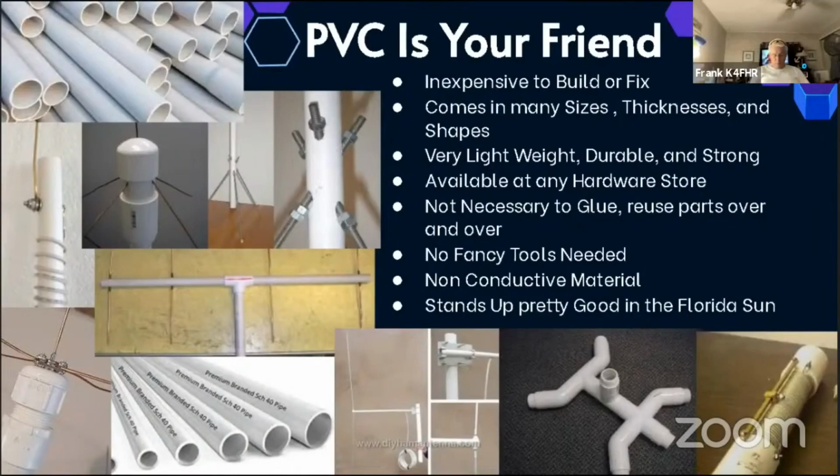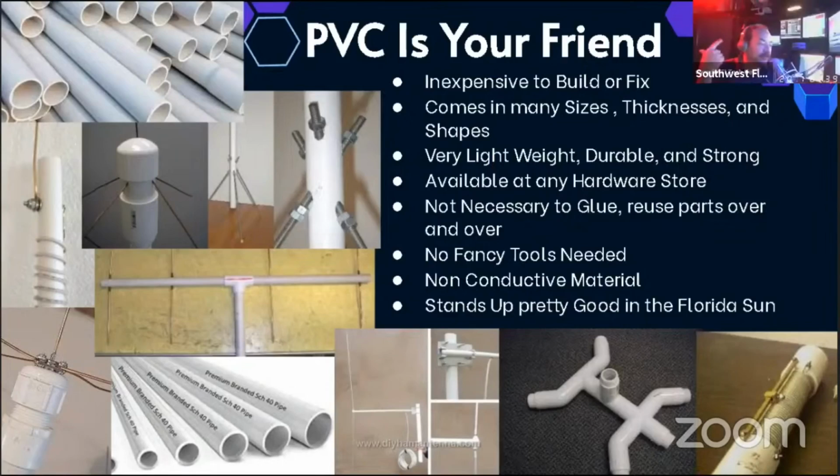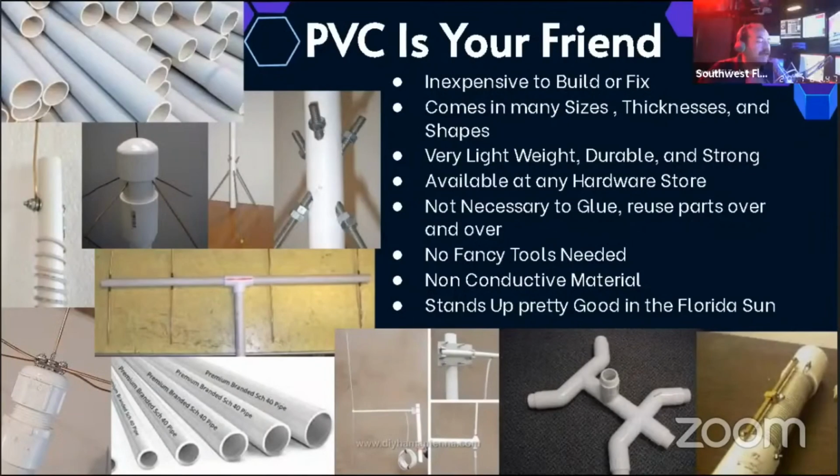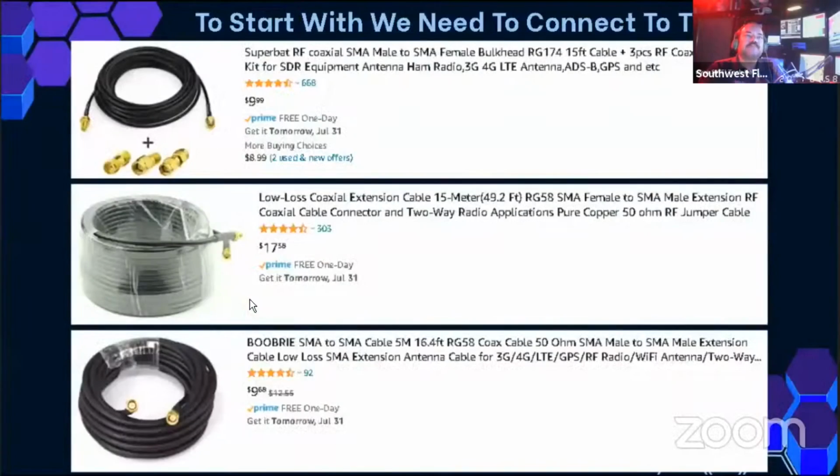I've got Yagis right now that I'm using up there that don't even have hairpin turns on them. And I'm at 1 to 1.2, 1.3. So when you don't have any conductive boom or a conductive mast, I really believe that makes your SWRing easier. That's a personal opinion.